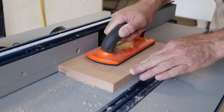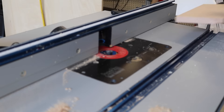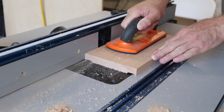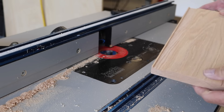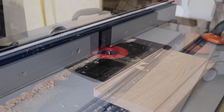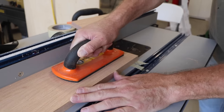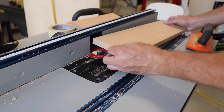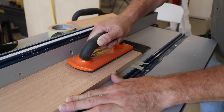The outside pieces of the box actually have dados cut into the top and bottom. The pieces we just made on the CNC machine slip into those dados as the shell of the box is constructed. The dado also provides about an eighth of an inch reveal for the face of the box. On these long pieces I don't want the dado to blow out the end because that end grain is actually exposed on the box, so I have some marks on the router table that give me an idea of where to start and stop this cut.